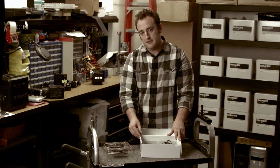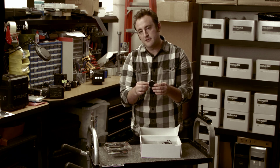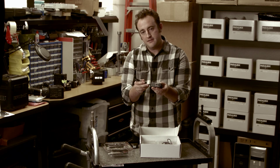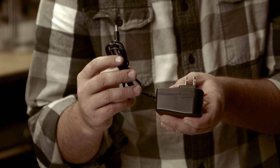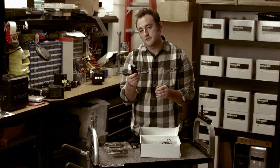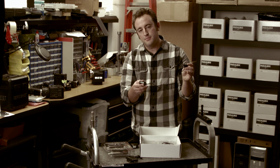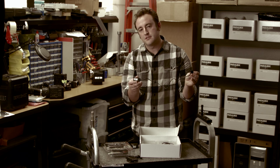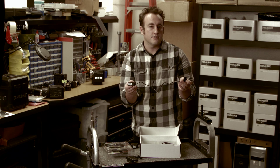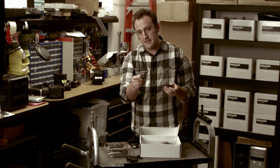Next, let's take a look at the accessories that we include with the Aero. You get an AC to USB power supply for your transmitter. You also get an AC to 5 volt barrel receiver power supply, great for use on a cart or if you're putting your receiver on a C-stand. We also include one USB tap — this is a P-tap to USB power solution that will power your transmitter, your receiver, or you can charge a smartphone like an iPhone or a Droid with the correct USB cable.